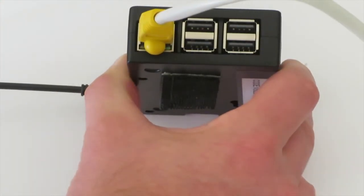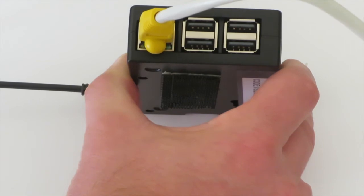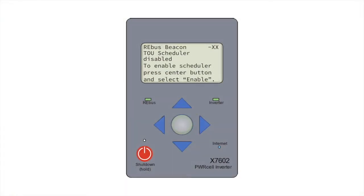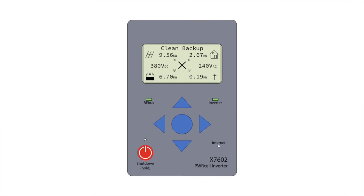When powered up and connected to an active Ethernet cable, the amber and green lights will illuminate. Let's confirm that we can scroll through the device pages and see the beacon device page listed. Once the system is connected, the blue internet light will illuminate. We are now ready to set up the system to be monitored through PowerFleet and the Generac PowerView app.